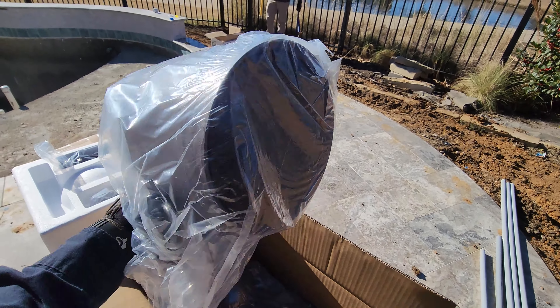It's going to be a nice seating area. All burial-rated cable, and we have an extra 14-4 run through here as well in case they want to add additional speakers or do anything different in the future. That goes through the conduit. Here's our other speaker location, and then we're going to go up into the wall here shortly. We've got everything backfilled, one speaker positioned here — sod is going in later this week. We're wiring in the subwoofer right now, which distributes out to the speakers. The other speaker is back up over here.